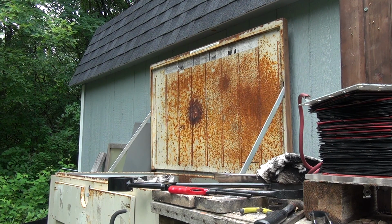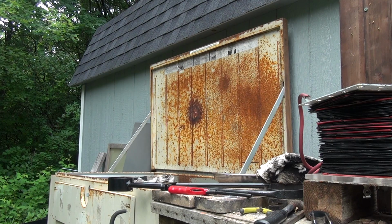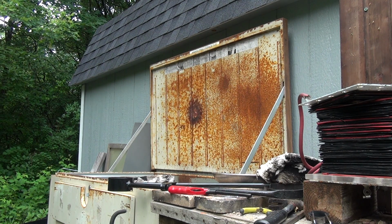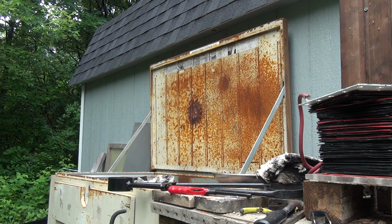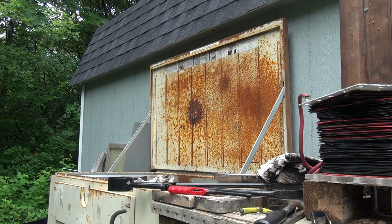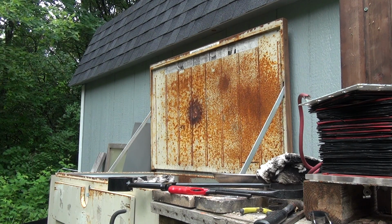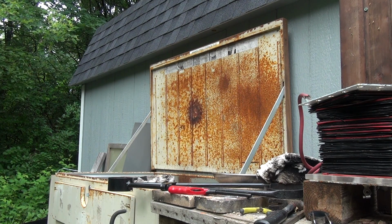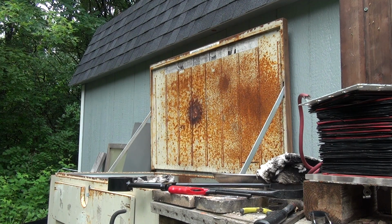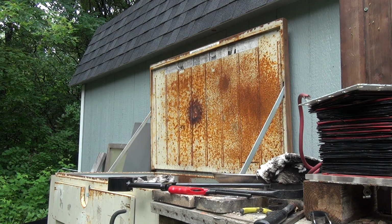One thing you have to really be careful of, the air pump that I'm using is plastic. The hose is plastic. It's going up to a metal pipe, which is going into the furnace. If I were to turn off the air first and not turn off the gas, then that heat would go right up the pipe and melt the hose. So what I've got to do is shut off the gas, or instead of turning off the air, pull the hose away from the metal tube, since it's just loosely connected, and then shut it off. But I think shutting off the gas first and then pulling off the tube, something like that. So I'm going to give it a few more minutes to melt.